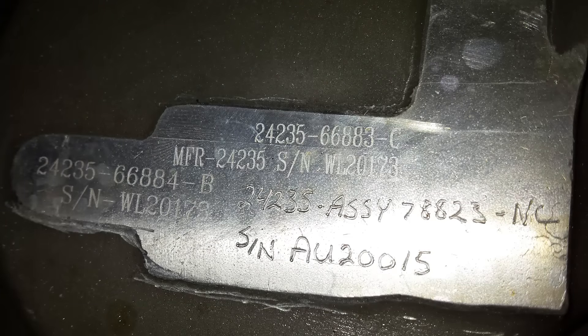There can be two reasons for this: one is the AGB case came unmarked and the final AGB assembly number was electric penciled onto it, or because it may have been overhauled or reworked with newer parts requiring the AGB assembly number to be changed. The same process works if you use the electric penciled AGB assembly number to determine the correct AGB carbon seals.